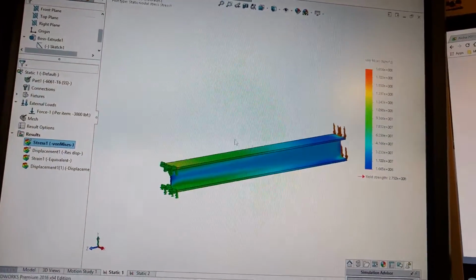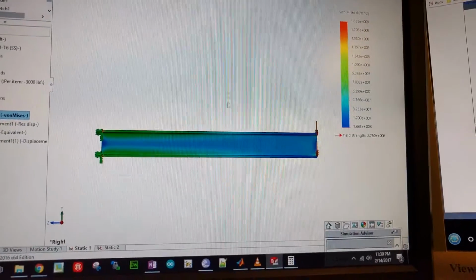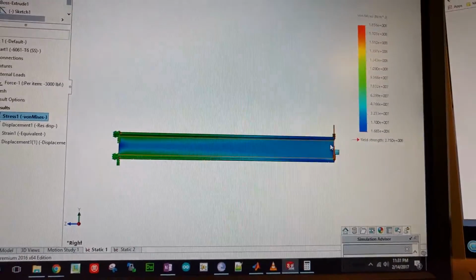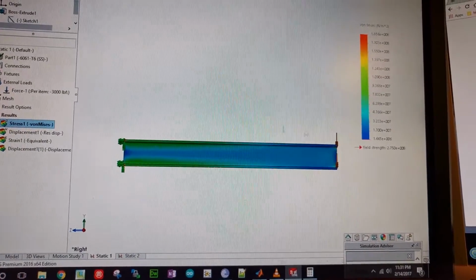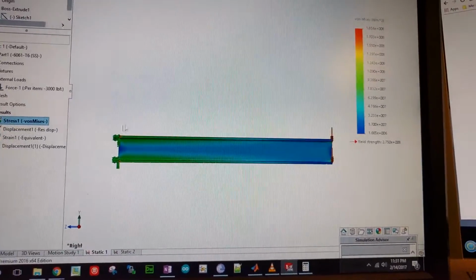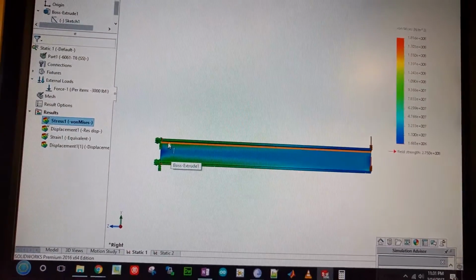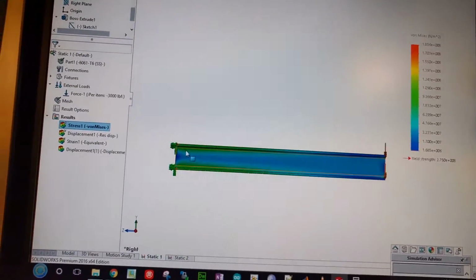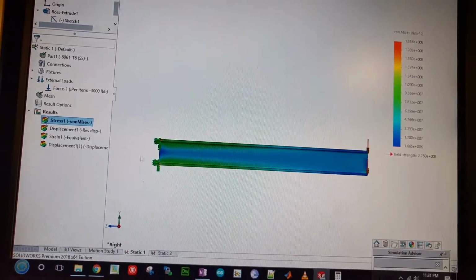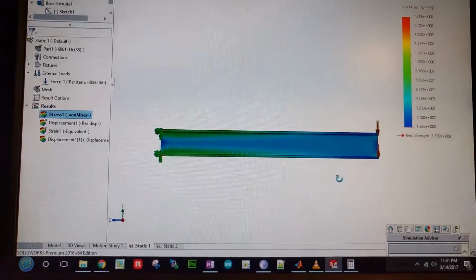Now this makes sense because think about it like this. If you have your car and you're trying to undo a lug nut, and this is a breaker bar, and you have your lug nut on this end, and you're leaning or standing on your breaker bar over here. If this system's going to fail, your lug nut and your breaker bar, where is it going to fail? Well, it's certainly not going to break the handle off of your breaker bar where you're standing, right? It's going to break either the connection between your breaker bar and the socket, or maybe the socket will break, or maybe the lug nut itself will break. The stud in your car will break off or shear off or whatever. All your failures are going to be on the left-hand side, so that's where we're going to expect to see the failure point, and that makes sense here, right?